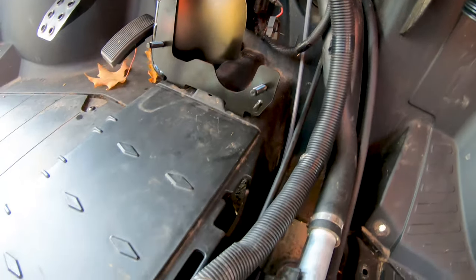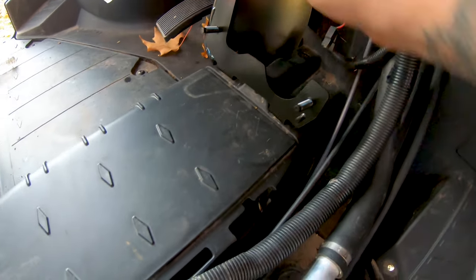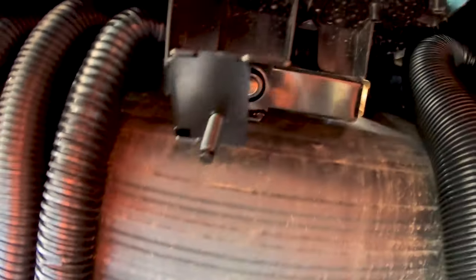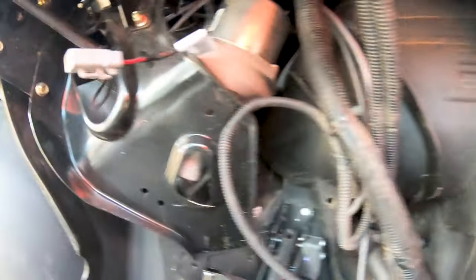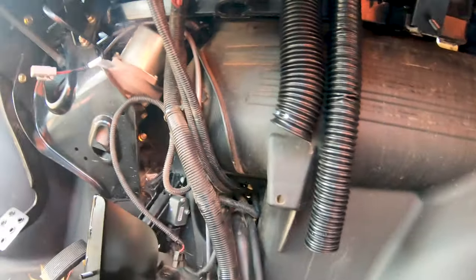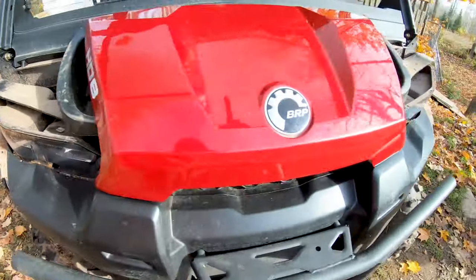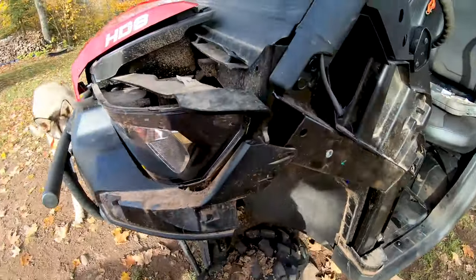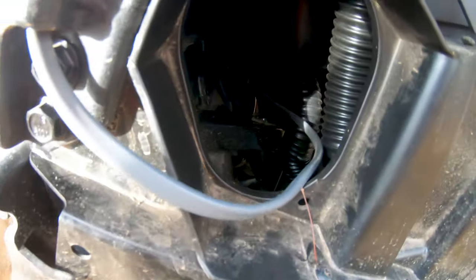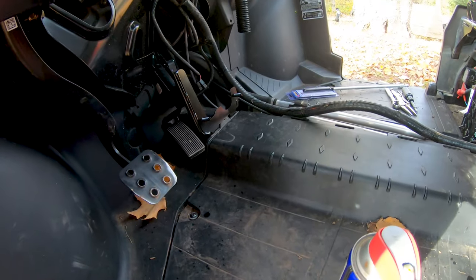This is where I left off last night. The riv nuts go down in here for the bottom support — that's fairly sturdy, not going to go anywhere. I tightened those down pretty tight. The upper support is in on the right side and the upper support is in on the left side there. So I can put the fenders back on so this can all be reassembled. I'm going to push up that hose a little bit more so there's no bending below. I'm going to put the fenders back on and then go to the next step.